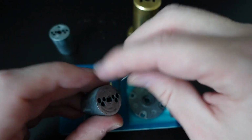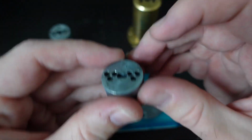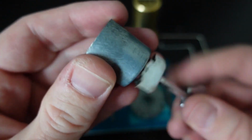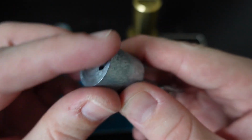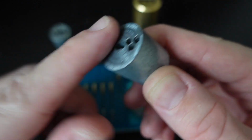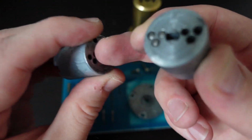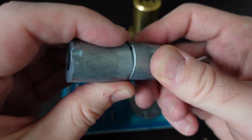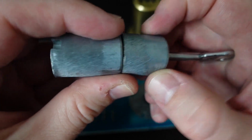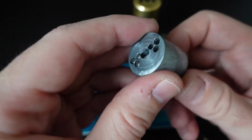Normally the key pins are just chilling in here. I will demonstrate. Let's just insert 3 of them in here. Okay, so they are there without any key. And now I will just put the key in, and you can see that suddenly they reach the shear line. This basically is the shear line, all of this surface. And this is where the drivers rest. There are no drivers in there, but if I put them there and you join these pieces, you have a lock that works like this, a pump lock. So hopefully you can see the whole point of this lock.